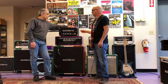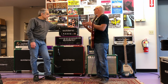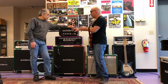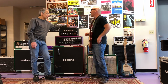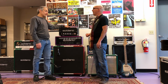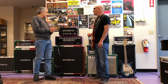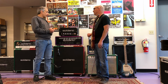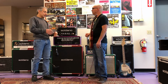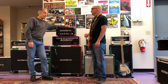I have a question. When it comes to the pedal, how did you approach the preamp circuit? Are you not using the entire 12AX7? Do we have 12AX7s in here? Yeah, just two of them. One's a phase inverter and one's the whole preamp. So it's a super simple circuit. Again, virtually no gain. I just extracted the clean channel out of Lucky 13, left the reverb off of it and stripped it down to its bare essence. It's about as simple of a preamp as you can get.